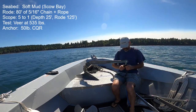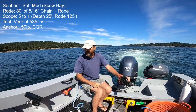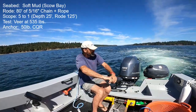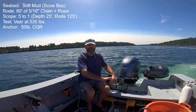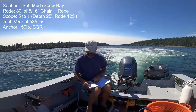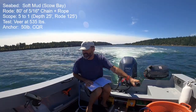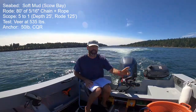This is a 50-pound genuine CQR anchor. It took two tries to get it to fully engage and hold the 535 pounds needed for the veering test, but it did eventually achieve that and throughout the veer it was fairly solid. I noted the GPS track arcing through 180 degrees was a nice semi-circle without any bumps. In the final straight-line portion the anchor was solid at 685 pounds, then had a full release at 790 pounds. The anchor did not want to reset once it released. It was solid at 685 pounds.